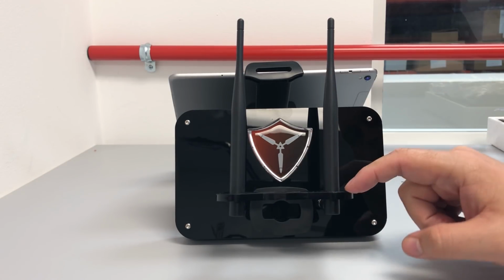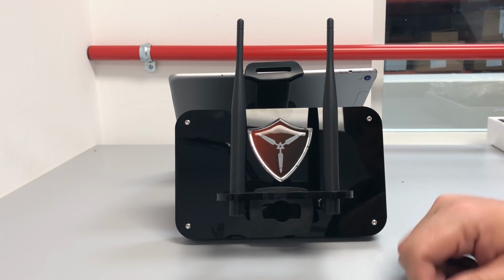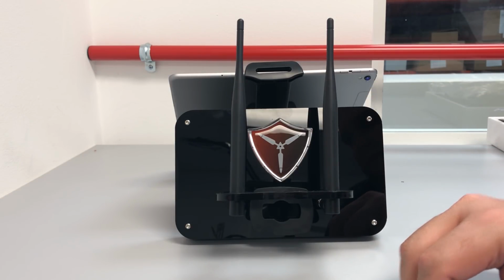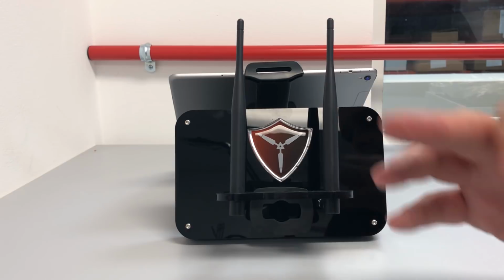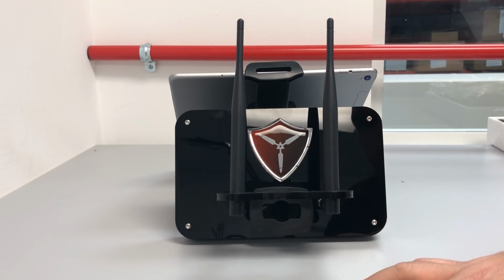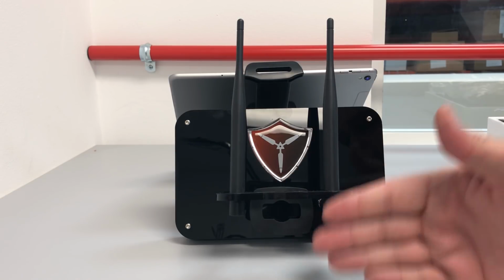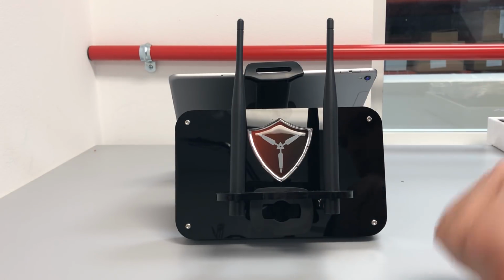In its current configuration, this has omnidirectionals connected to the switch panel. In this scenario, you'll use this when you have physical obstructions close to you, like buildings or trees. That dome of radiation has a better capability of getting some signal between the foliage and the trees, or maybe between the buildings when you have to fly behind them, or basically in areas where a directional signal will bounce off of that physical obstruction if it's too close to the antenna. So that's when we like to use omnidirectional antennas.